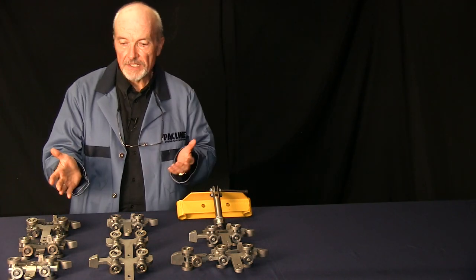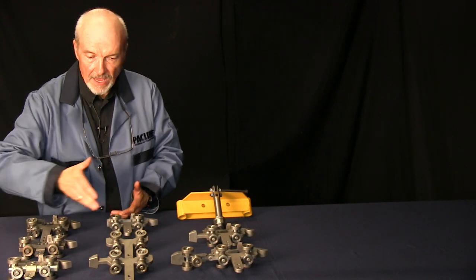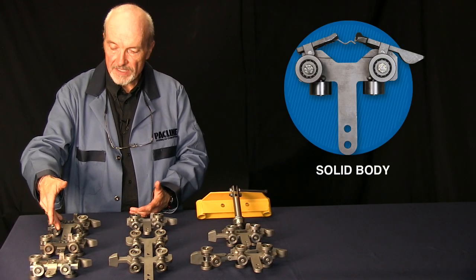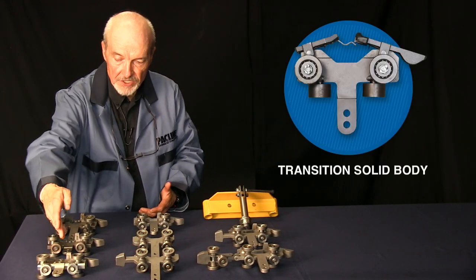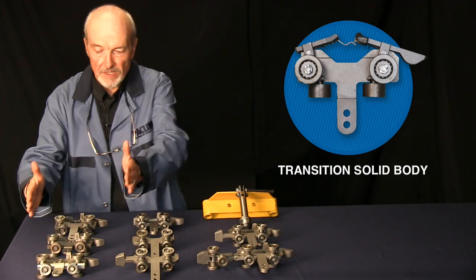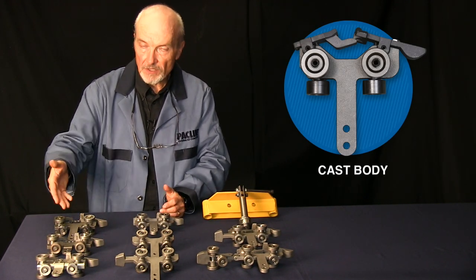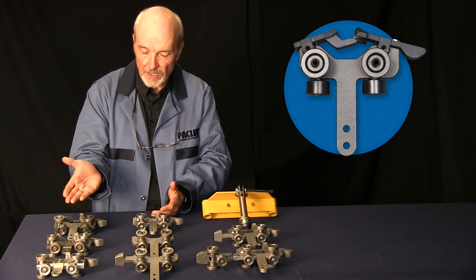This is our S310 power and free system, and there are three generations of trolleys. This one from 15 years ago is a folded body style. This one from 10 years ago is a solid body style — it gives you much more strength and robustness than the older style. The transition between the two is that we machined it down and made it thinner for systems that are 15 years old; these are basically for spare parts. Our newest generation over the last six years is the cast body style, which gives you the robustness but also the precision of a cast trolley, making the system perform much better.